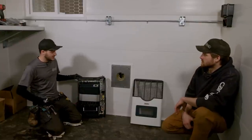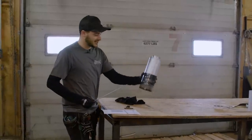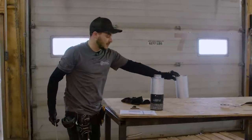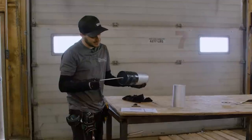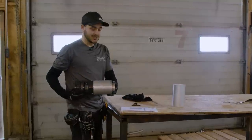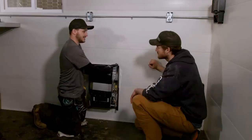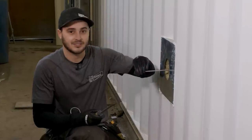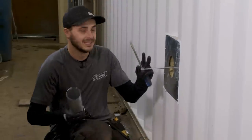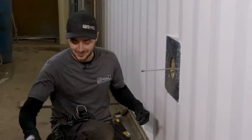We're cutting down the exhaust pipe right now — it comes with a wall thimble pipe that's over 12 inches long, but our wall is only about five inches thick so we need to cut it down. Josh just cut it down — we've taken quite a bit off as you can see — so it can go through much thicker walls but our wall cavity is as thin as we can get it. After struggling with this for a while, we realized this is a threaded rod and the nut on the back end comes off. The steps for putting the exhaust piping in: get your threaded rod in there first, then your small pipe and your large one, and put the nut back on afterwards — it'll be very simple.